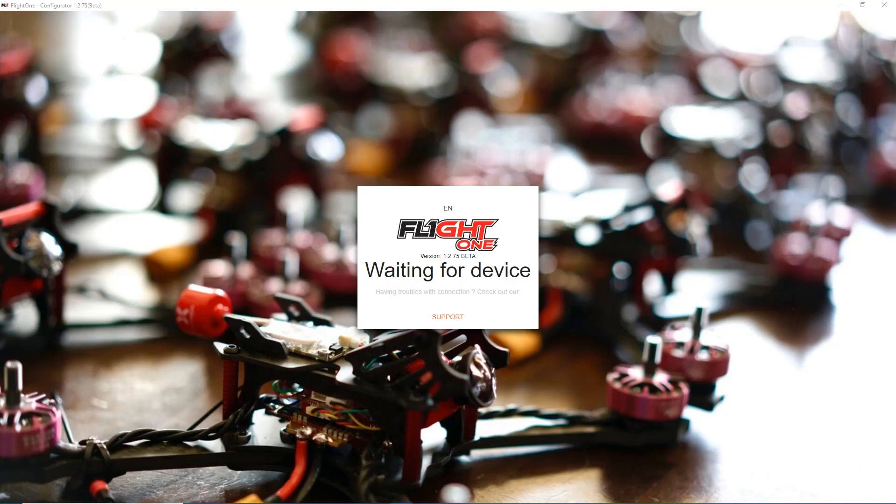Let's go ahead and open up the Flight One Configurator. Right now I have version 1.2.75, and as of today there is 1.2.85 available. We're going to go ahead and get into DFU mode — it boots the flight controller into that mode, allowing the bootloader and firmware to be updated. It's also used when coming from a really old version, if you want to wipe settings completely, or to restore a flight controller that's no longer connecting properly. One more thing: if your S-port is soldered, go ahead and unsolder that because sometimes DFU mode won't work. You don't need to solder the boot pins for this to work. Go ahead and connect your flight controller.